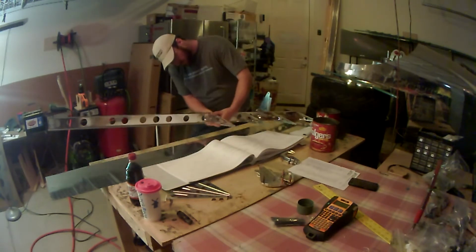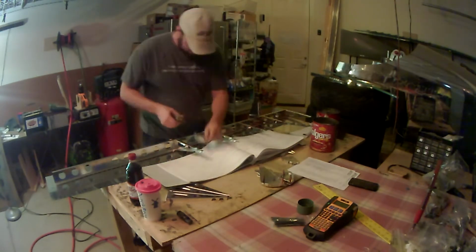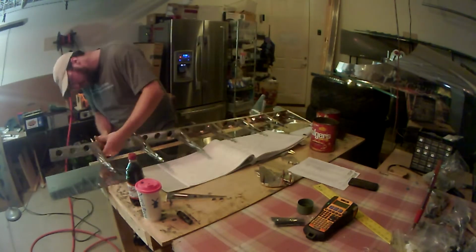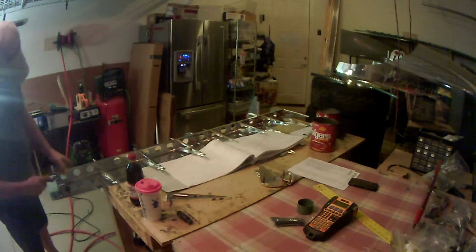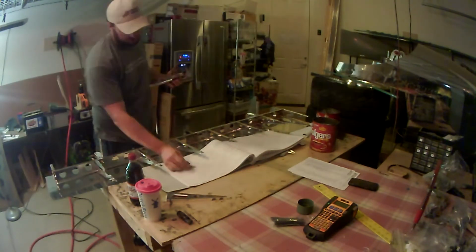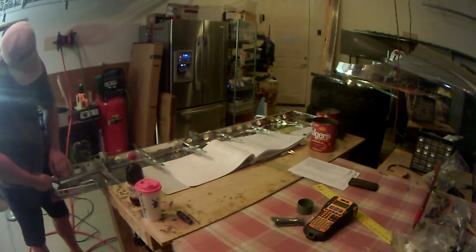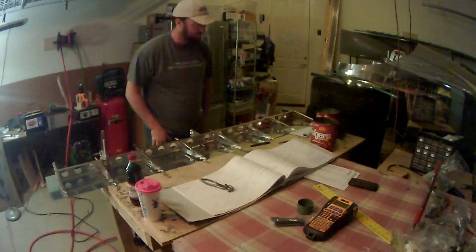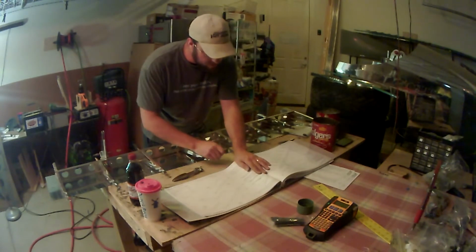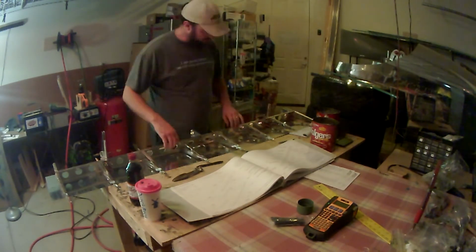So anyway, as you see here, I'm starting to assemble the frame of the flap. You see the piece that's sticking up, that is the flap attachment subassembly. That's one of 2. Those are the pieces where you only drilled the holes in the left half of it. It has you assemble everything as I'm doing here, and now I'm putting on the second flap attachment subassembly. It has you assemble everything and then get the hardware out and install it and put washers in place to hold the 2 halves, separated where they're supposed to be, but hold them in place. And use all of that to line it up, and then drill the holes and match drill the right half of each of those subassemblies.